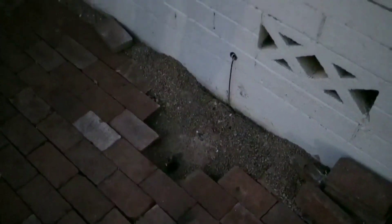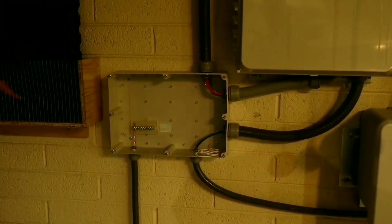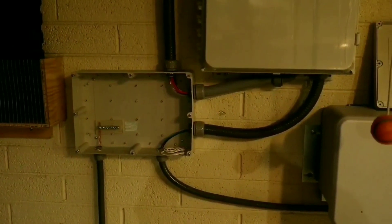It comes out the wall and I got the ground rod installed — that was definitely interesting. That thing's eight feet long and it was surprisingly easy. I couldn't believe how easy it went; I was able to drive it in just by hand most of the way. The last 18 inches I had to use the hammer. I just put a little bit of water in the hole, slid it down, lifted it back out, put some more water in, and it just sank right in — it was fantastic.